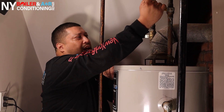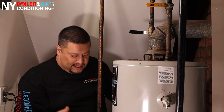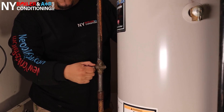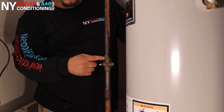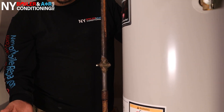First things first — water supply going to the house, that's first. Second thing is, you want to shut off the gas valve. It's very easy — it's an old-style butterfly gas valve. You shut it here with a pair of channel locks. Again, when it's in the parallel position, it means it's open. When it's in the side or horizontal position, that means it's in the closed position.